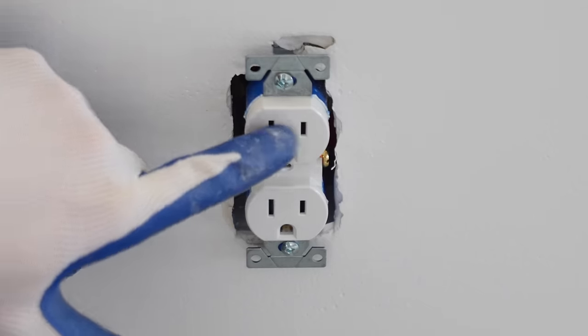In order to use this, we simply, like I mentioned earlier, just open up the levers, or the levers, either term. So then we're gonna slide our wire right into the nut, and then we're gonna close it shut. And then in this case, we're gonna tie these black wires together. So I'm going to place the other one in here and then shut it, and then do the same to the white wires. So more or less what this does is bypasses this whole round electrical box and continues the power to wherever we need it. Now we got a nice solid connection.